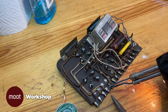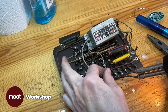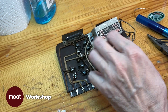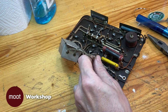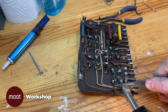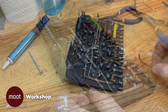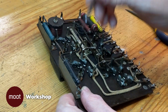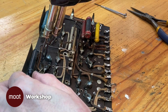This little silver block is a giant capacitor — actually two capacitors in a box. I think it was added later because it doesn't appear on the schematic, probably to decrease buzzing. The sockets for the tubes have a little clamp for each of the pins that holds onto the insulation of the wire, so I have to pry that open before I can unsolder the wire off the top of it.